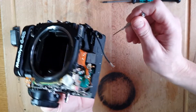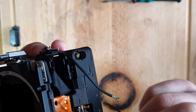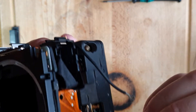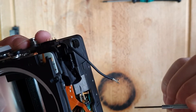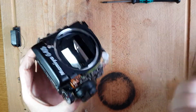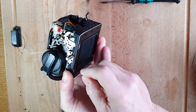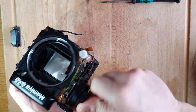This can be done using a very small white tab just underneath this brass screw. There is a white pin, and what you need to do is get a small screwdriver and push the white pin across. This brings the shutter curtain across and brings the mirror back down. You should now be able to advance the wind crank forward. If you can't, you can push this pin in here and it will unlock itself and allow you to crank the camera on.